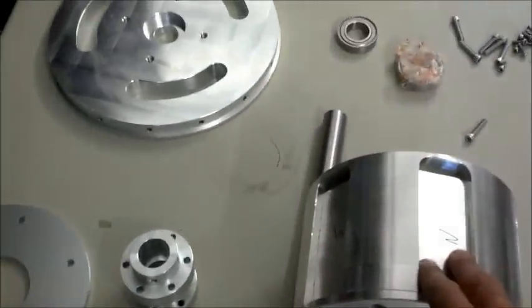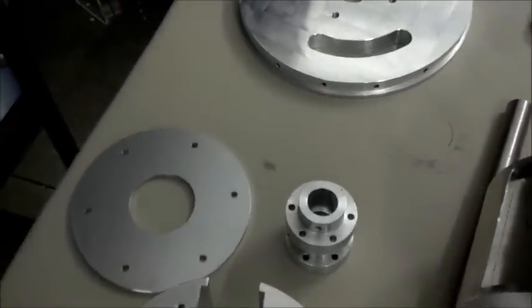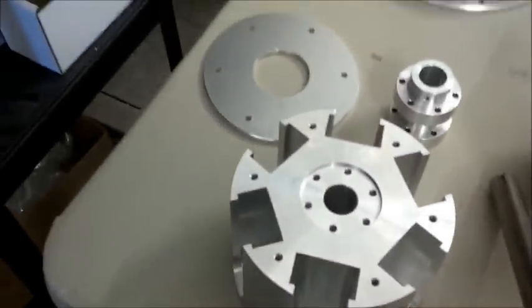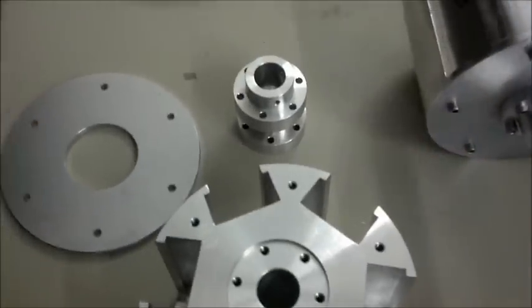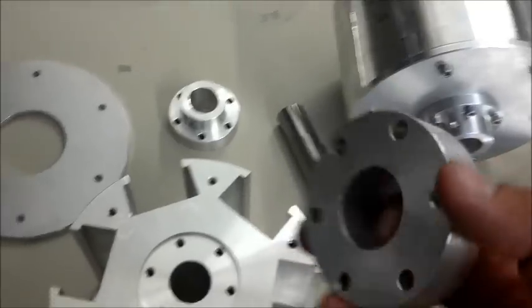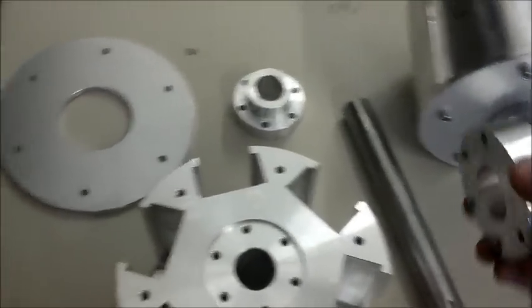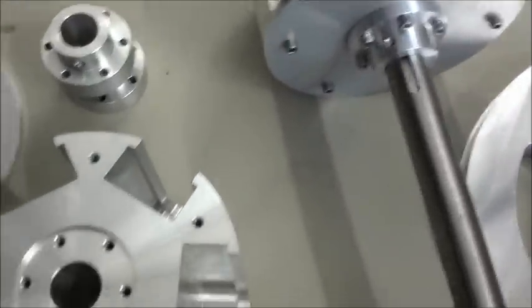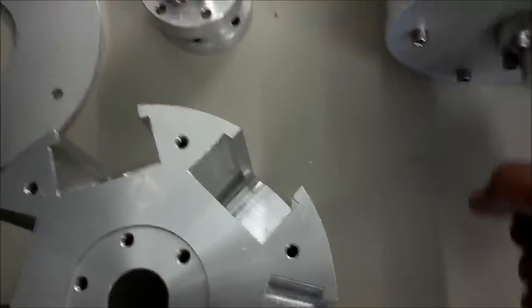You could put epoxy in there to prevent any shaking, but they're pretty tight — pretty good in there. The shaft is one and an eighth inch stainless steel. You can see the grooves here for a keyway that will be provided, and on one side of these end caps will be grooved out so that you can put the keyway in. There's also a keyway on the outside there to allow for keying.